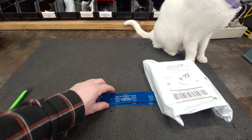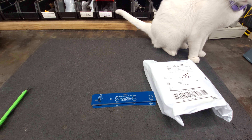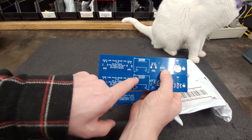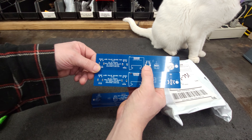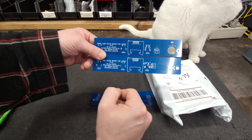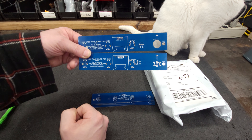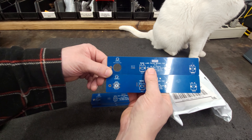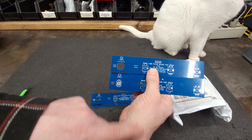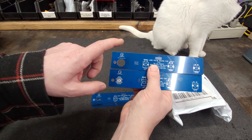Let me grab the prototype — we have done some changes. Removed the mounting holes, and I did a little bit of relocation in that neighborhood. I decided to nix the PCB board-mounted switch and just go with a panel mount switch. You can either run one with an LED in it, or you can use the LED in the factory spot.